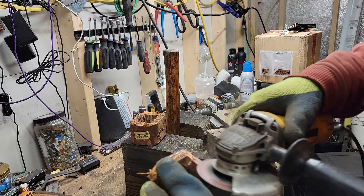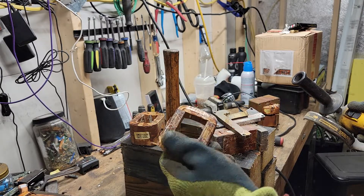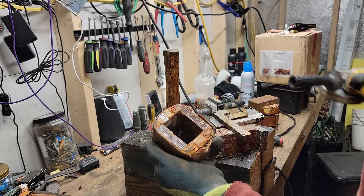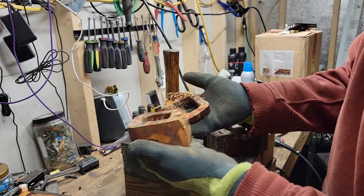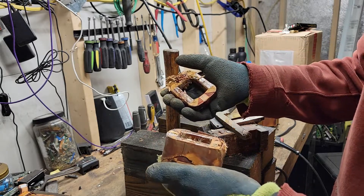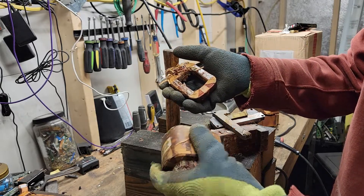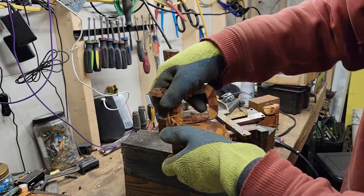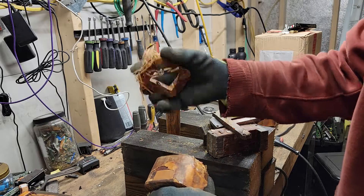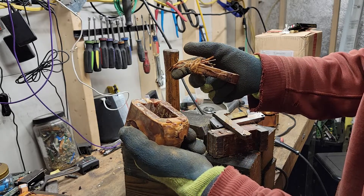Let's show the shiny — there's the nice shiny copper right there. And this here is aluminum — that'll be silver. What's funny is the copper weighs more than the aluminum, so you're going to know if you have a copper transformer or an aluminum transformer. The all-copper transformer is going to weigh a lot more — that is a fact. This is almost three times the size. One piece of copper is actually a pound and a half; I've already weighed them. And this is nine-tenths of a pound — almost a pound.